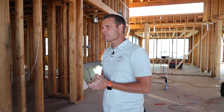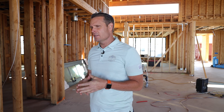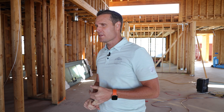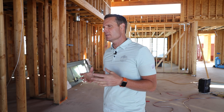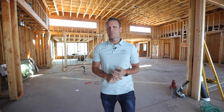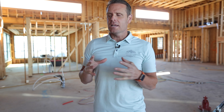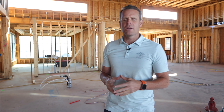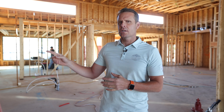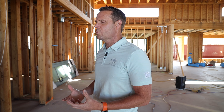During the box walk, one thing that comes into play is the layout for ceiling fixtures as well as all of the can lights. Weight comes into play — sometimes designs may have a hundred-pound chandelier, and some light fixtures are even heavier. We have to plan for backing in some light fixture locations for pendants and chandeliers, understand where sconces will be installed, and plan outlets for smart toilets. All these little things come up at the electrical walk.